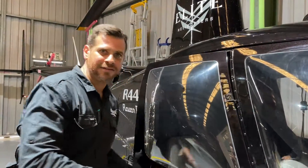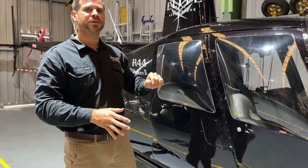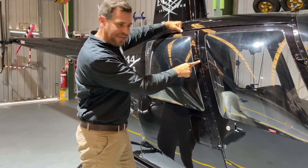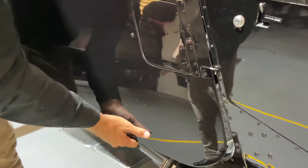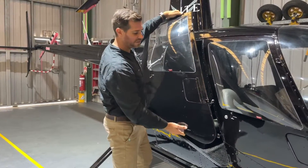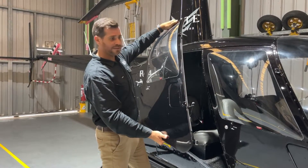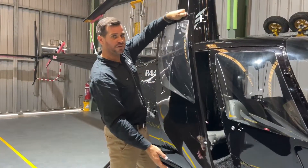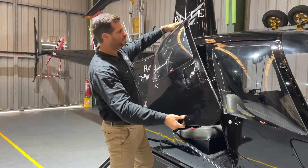This part requires two hands. Some doors are a little bit trickier to get out than others — I think this one is a good fit so it should be nice and easy. You can see we've got a pin on the top section of the door and also a pin on the lower section. We need to make sure both those pins come out. The recommended way is to gently open and close the door as you're lifting it up, and you'll see it pops out quite nicely. Make sure you've got a good grip on the top and bottom of the door — don't try to do this one-handed. You are likely to drop the door, which could result in scratches to the perspex, which is really hard to get out. So now we've got both pins out and the door's off.